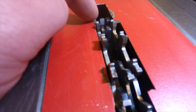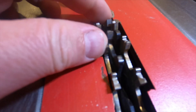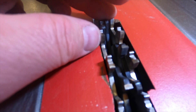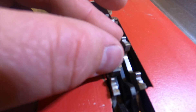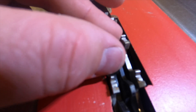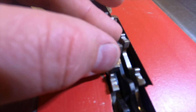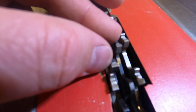It's the outside edges of the dado and rabbit that need to be nice. When you put a stacked dado blade on, you want to make sure the teeth are staggered in between each other so that the carbide pads of one tooth do not hit the tooth of the other, because as you tighten up this blade the carbide could get crushed if the blades are right next to each other.